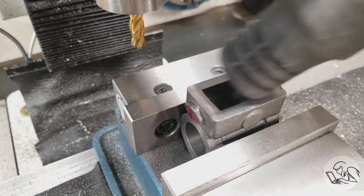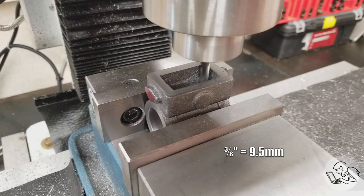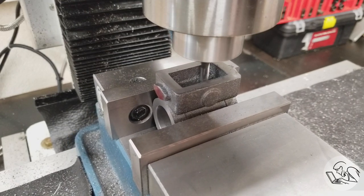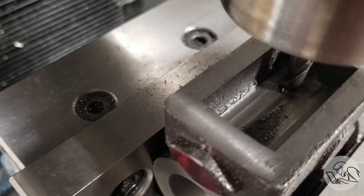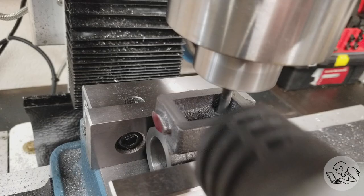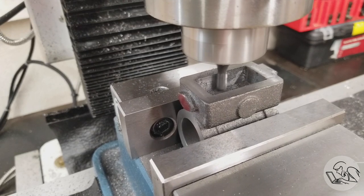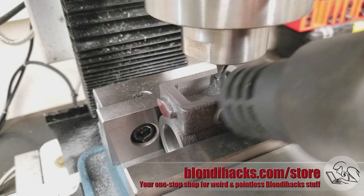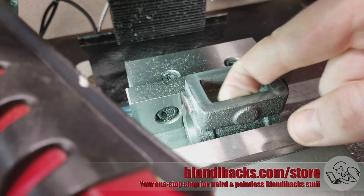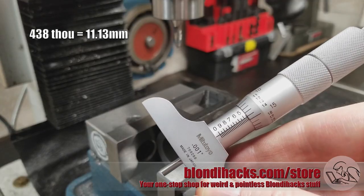There's going to be lots of vacuuming in this process. I did some depth sounding to get a sense of how much I need to remove to clean it up. I'm setting up with a three-eighths end mill to machine the bottom flat first. This is a little bit larger radius than might be desirable on the inside corners of the steam chest, but if I use a really small one I'm going to be here all day. After a couple of passes it's looking good. Now I can machine the sides — there are no dimensions on any of this, it's just about cleaning it all up. The valve is smaller than the steam chest and just floats inside on the valve rod.